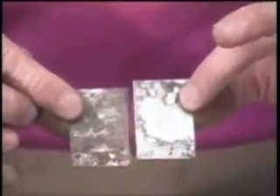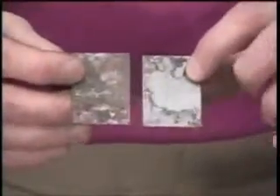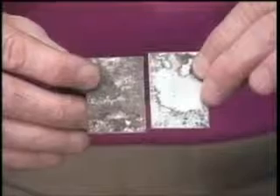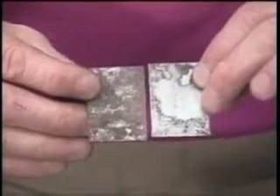These right here are just small coupons. Even if it's dirty, rusty, oily, or greasy, if you're doing steel welding it still does a very nice job. I've got a piece here that's just a little rusty and one that's clean. For a lot of you guys putting fenders together and so forth, give yourself about a 16th to a 1/8 gap and tack it about every inch to inch and a half.